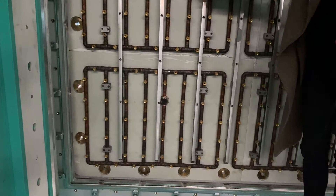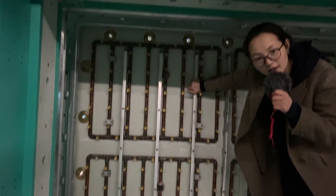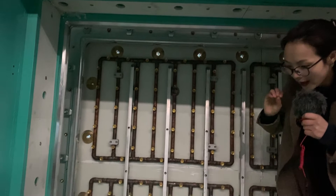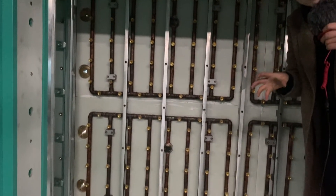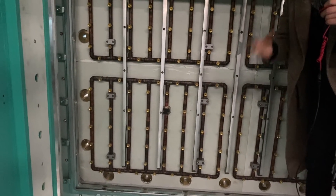For more information, the reason why we designed this is because we want steam to enter the mold cavity in a short time, to save steam and to improve the heating result.